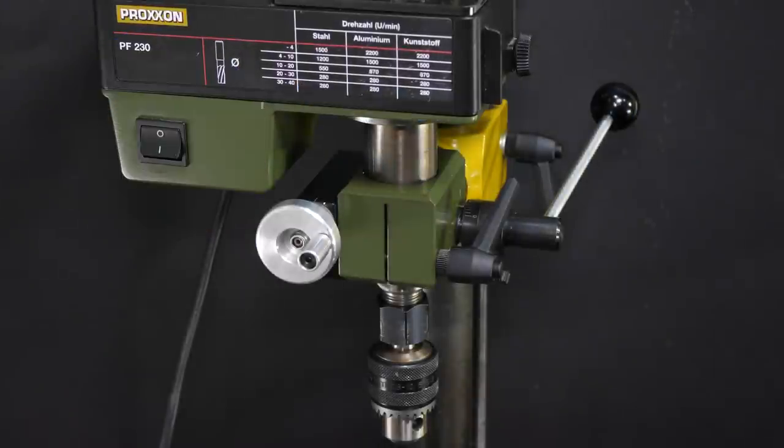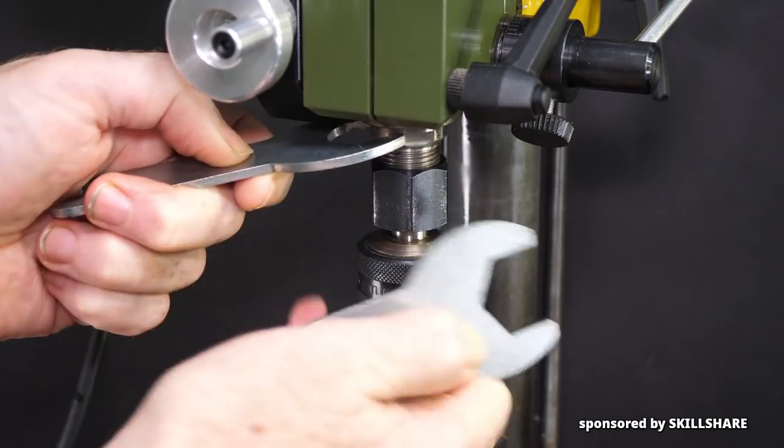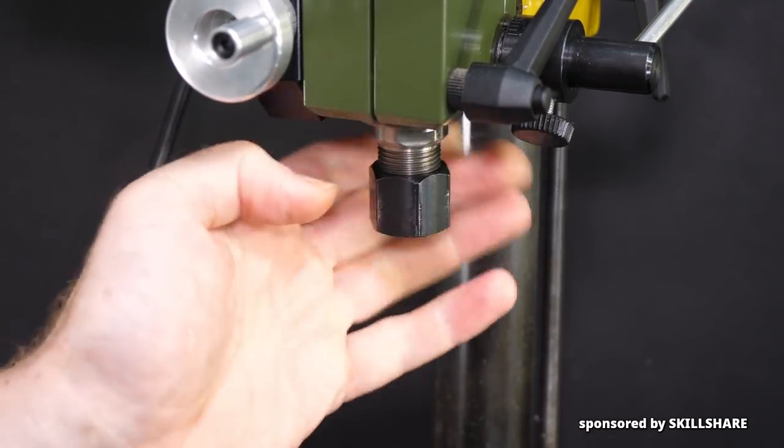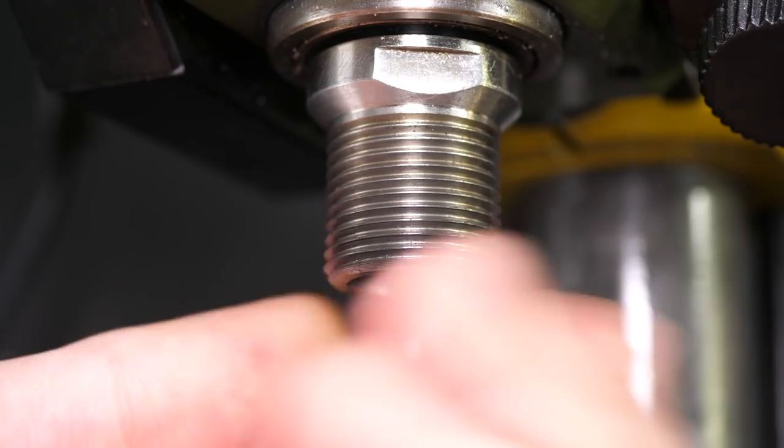Welcome to Adventures with a Very Small Lathe. The Proxxon mill can't use most mill tooling. Most larger mills have a general purpose spindle taper which can accept boring heads, chucks, fly cutters and all kinds of tooling, but the Proxxon only has a very short collet taper, and a thread for the clamping nut cut directly into the spindle.